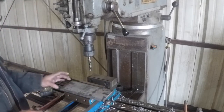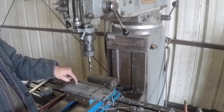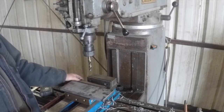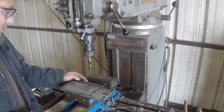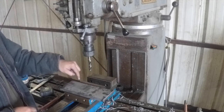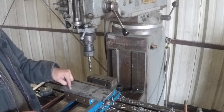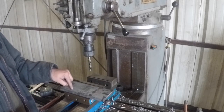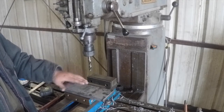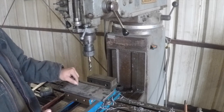I just thought about it — we're going to offset the holes for this one over to the left side of this plate, and this is actually the same setup I need to drill these holes out. So on one side we're going to drill two holes and they're going to be tapped. On the other side we're going to drill through holes — they're not going to be tapped, they're going to be the full size to fit a 5/8-inch bolt — and we're going to bolt this plate up to the plate we just drilled. The side that we tapped is what's going to clamp onto the I-beam.